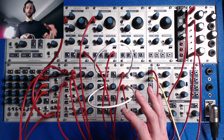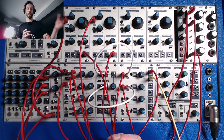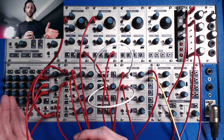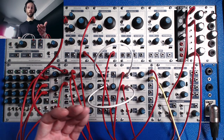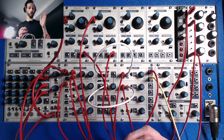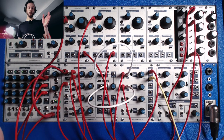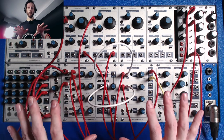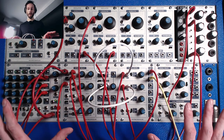You can sync from an external clock if you have a converter, or if your output device, the source of what you're syncing to, has like CV output, a clock source, or like a drum machine, just take a hi-hat, put it very short decay and just send it to the 5-step voltage source. In the day, they would use a 909's rim shot to just trigger and clock other synthesizers. So you can do a lot of stuff with this.